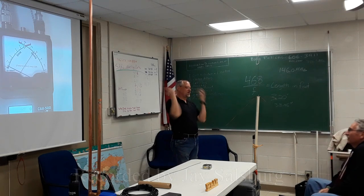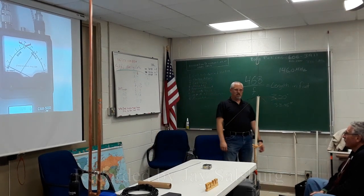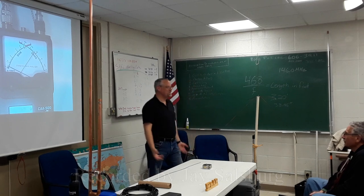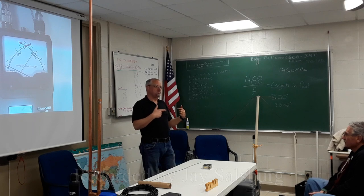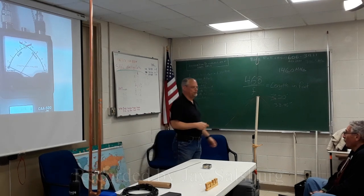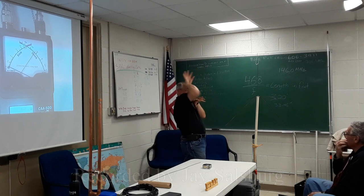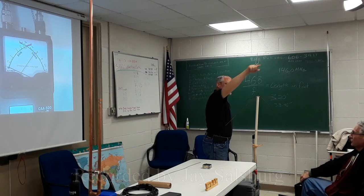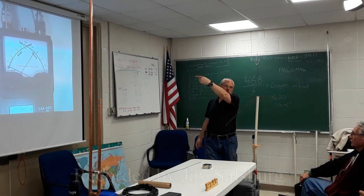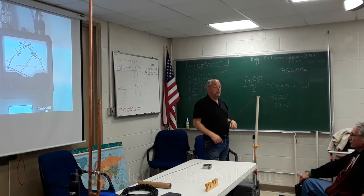Okay, now here's the next question. What did I just do to my radiation? That is one funky looking pattern. It went from this to this. Where's my signal going? Just because I'm getting to resonance doesn't mean that the signal is actually going where I think. It may not be an omni anymore, is what you're saying. Here, I'm going to be sending a lot of my signal up that way. Here, I'll be sending it kind of between these. Whoa. I might want that.